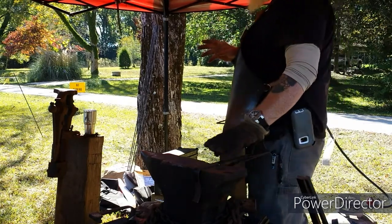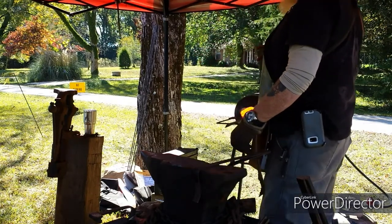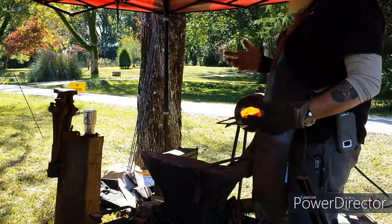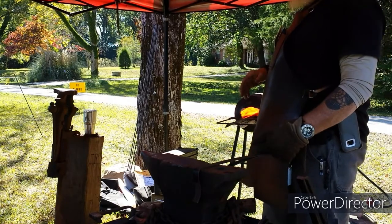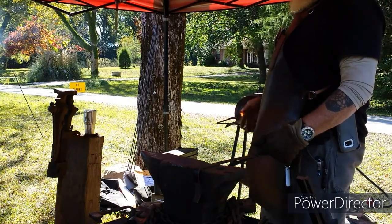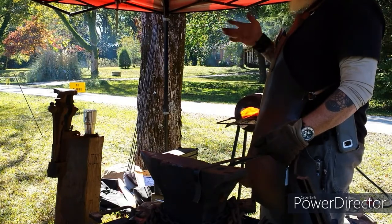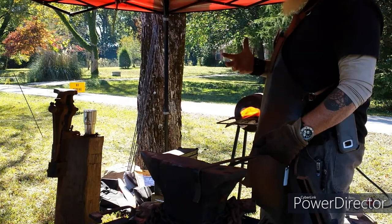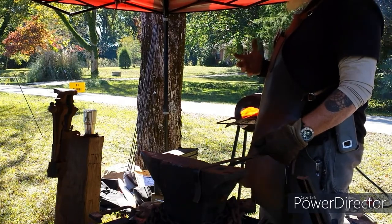They're still not the best to try to make knives out of. My go-to is a 1075 or 1080. And when I do Damascus, I just use that, and toss in a 15N20 for the difference in pattern. Both of those are good quality steels for knife blades.